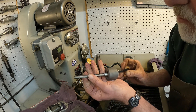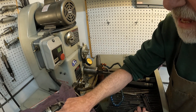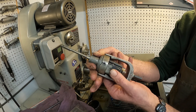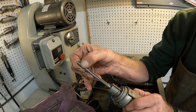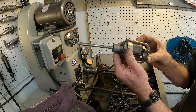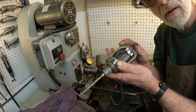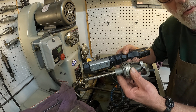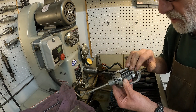When the wedge pushes on it, it just lifts that stone out. These smaller ones can be driven with a hand device — you can put it in an air drill or even an electric drill, and it works like the machine, believe it or not. When you push the lever it retracts the stone, and when you let up you can see it come up. It adjusts the stone right here. This is called a Hone-All — there's even a larger version you can drive with a three-quarter inch drill out in the field. There's a lot of versatility.